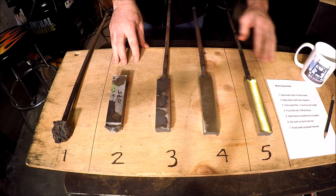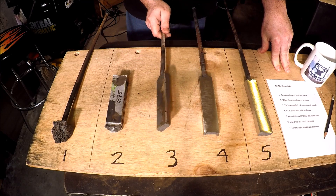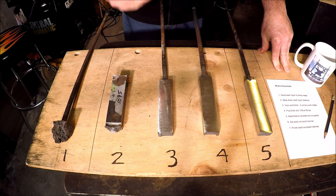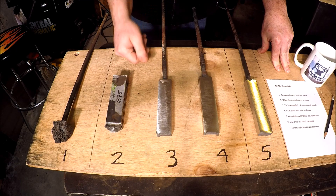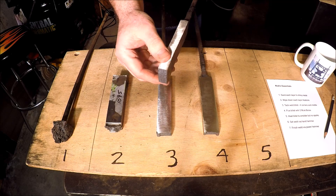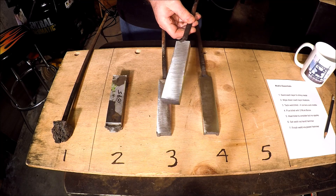I took a step back, really thought through what might have gone wrong, and looked at the video. I think one of the issues was I never used the power hammer to help set these welds — it was all done by hand hammering these billets, and I think that wasn't helping me. So I decided to make up another billet using all the same processes as before, but with one difference: using the power hammer. Sure enough, here's the fifth billet and I don't see any gaps, no small cracks — just one solid piece of eight or nine layer Damascus.